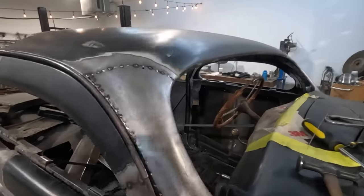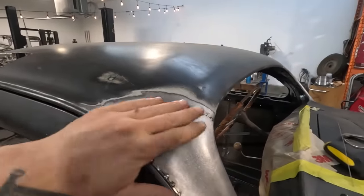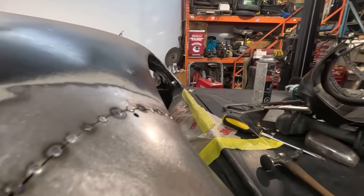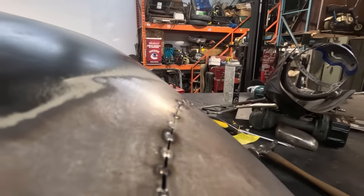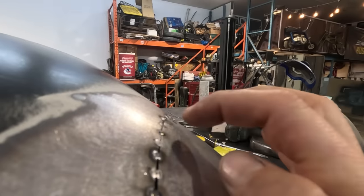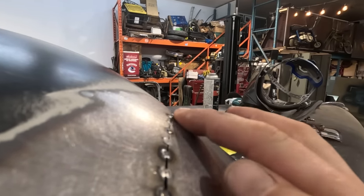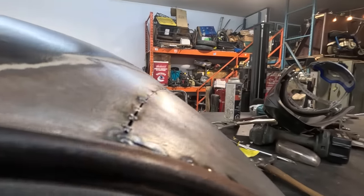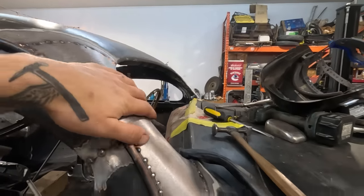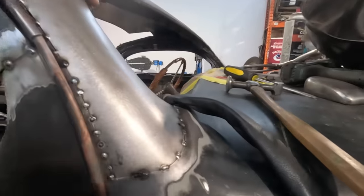All right, so I've got the pillar cap tacked in. Like I said, I just wanted as tight of a gap as possible. This way, on a convex shape, it's not gonna wanna sink because it's pushing against each other. You know, you want those tight gaps. Anyway, any time that you spend fitting is always worth it when you're doing this kind of stuff.